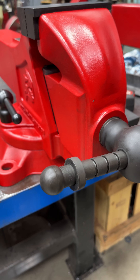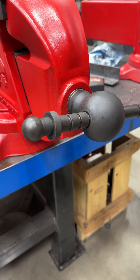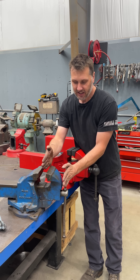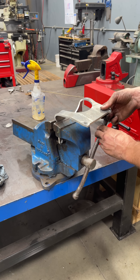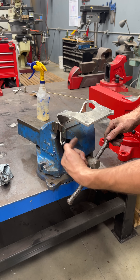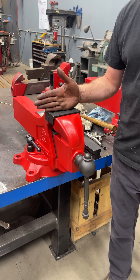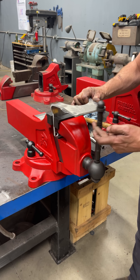There's a lot of machining in this — you've got the ends, the little knobs, and the rubber bushings that over time you can replace so they don't smash your fingers. There's a nice hardened meatball here. Sometimes the distance between the handle and the back jaw is really short and the handle starts getting in the way, so you have to choke up on it. Getting more space between the handle and the back of the jaw increases your capabilities, and on the hardtail the distance is much greater, allowing you to spin the handle without interfering with anything.